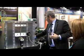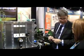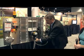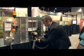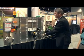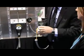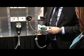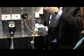Carrying on with the same theme of testing and verifying the system, we have a tester for the bearing temperature monitoring system. Behind the whirligig we have a bearing temperature sensor. We can disconnect that with the tool and remove the bearing temperature probe. We can place this probe in our handheld tester, set the trip point of what the temperature needs to be to alarm or shut down the machinery. And this is now heating that probe up to 122, 123 degrees. When it reaches that point, we should get the alarm or the shutdown.